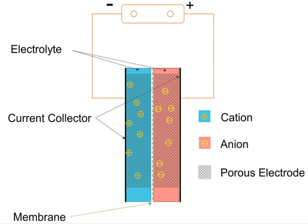nanostructures. The amount of charge stored per unit voltage in an electrochemical capacitor is primarily a function of the electrode size. The electrostatic storage of energy in the double layers is linear with respect to the stored charge, and corresponds to the concentration of the adsorbed ions. Also, while charge in conventional capacitors is transferred via electrons, capacitance in double-layer capacitors is related to the limited moving speed of ions in the electrolyte and the resistive porous structure of the electrodes. Since no chemical changes take place within the electrode or electrolyte, charging and discharging electric double layers in principle is unlimited. Real supercapacitors' lifetimes are only limited by electrolyte evaporation effects.